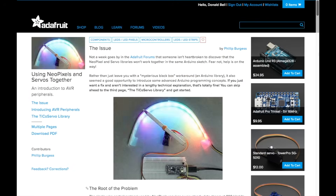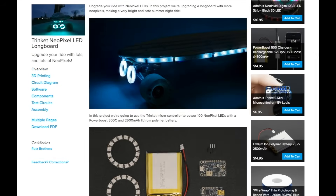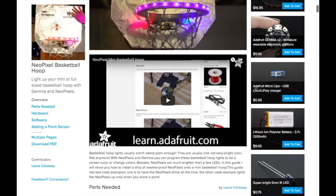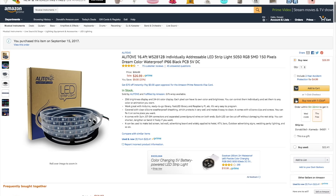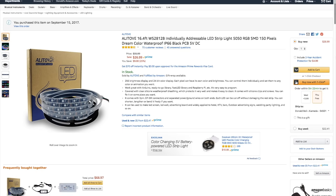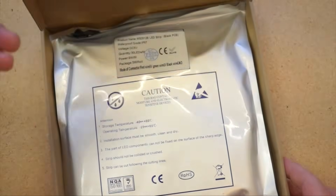Using the code or a competing code library like FastLED, you can control and animate the color and brightness of each LED on the strip using just a single data wire. The WS2812B variety of addressable RGB strip is compatible with both NeoPixel and FastLED code.